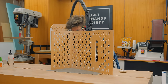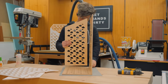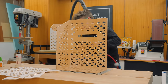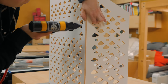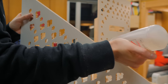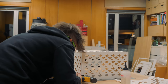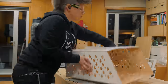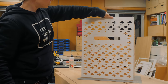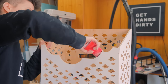The glue I use here is not specifically meant for this job — it's a quick-setting glue that has a fast initial tack so I can hold and pin nail the parts easier. As this plywood is pre-finished, I couldn't really use wood glue here, and I will be reinforcing these joints anyway later in the build. 6mm butt joints are not exactly super strong for a large object that will be holding some weight. So once the five pieces were assembled, I left it overnight and came back the next day to sand and spray it with water-resistant matte varnish.